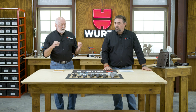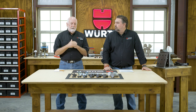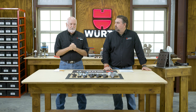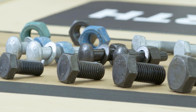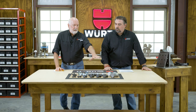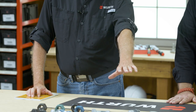To reiterate: the 120, 144, and 150 KSI refers to the tensile strength of these bolts. So the 120 group is 120,000 PSI tensile strength, and the 150 group is 150,000 PSI tensile strength. Our bolts are A325 or A490 based on whether they're 120 KSI or 150 KSI. They're hex head bolts.